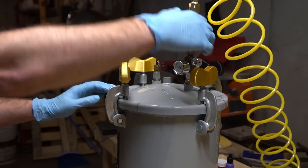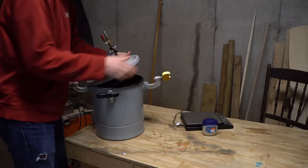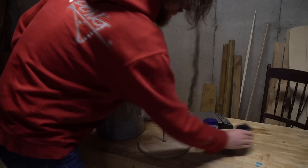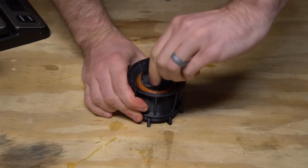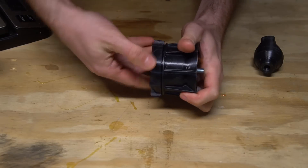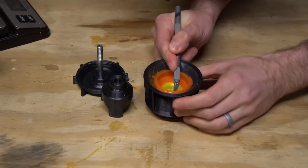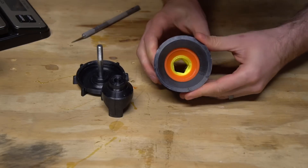Make sure to take the proper steps to get a good cast. Once the cure is done, take the mold out of the pot and disassemble it. If you've overfilled the mold like I did here and the urethane has cured up in the pour funnel, you can remove the mold insert and cut the spare resin away, which should allow you to easily demold the wheel.